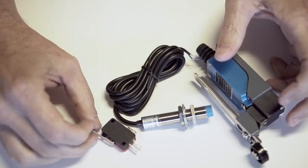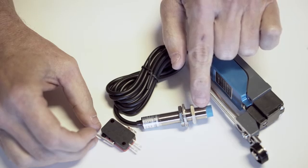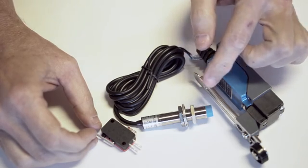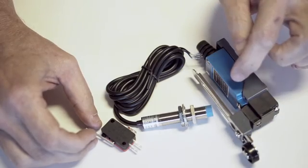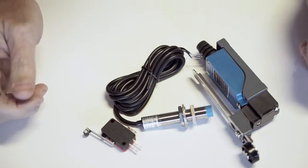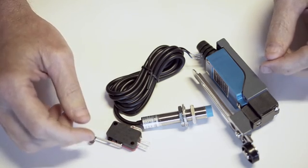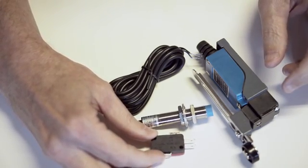The main differences between mechanical type switches and the proximity switch is that the proximity switch is solid state and has no moving parts, meaning the signal produced will be a clean signal, whereas a mechanical switch can have a little bit of bounce when it provides the signal to the controller or whatever you're hooking it up to. I talk a lot about the bouncing of mechanical buttons and switches on my microcontroller videos, and you can look at that video to understand more about what happens with the signal from a mechanical type switch or button.